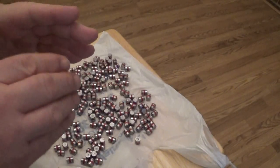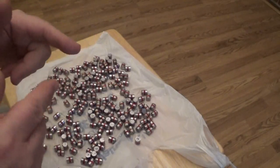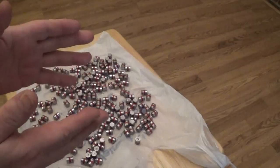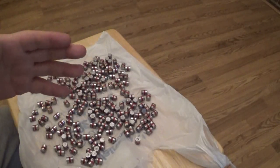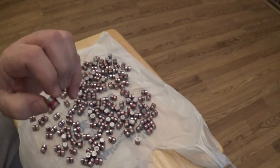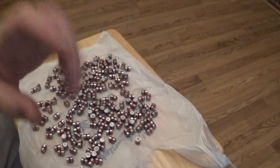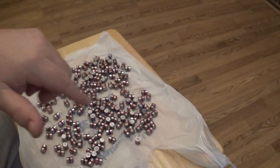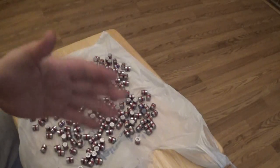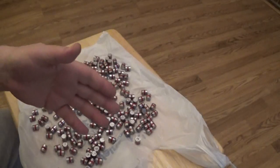You press it down and wait, press down and push it through — otherwise you get air-bound in your lubricator, and you don't want that. What I'll do when I make a whole batch — about two thousand of them — is take that die out, drill out the top holes, plug the ones in the middle again, and use the die just for the wad cutters when I do a production run, then put them away.